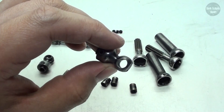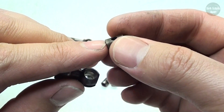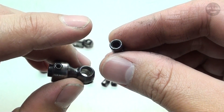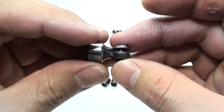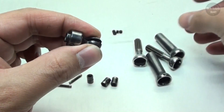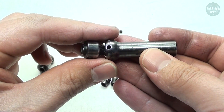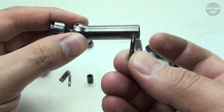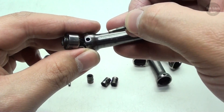I'm going to start off with the top of the drive shaft. Then I'm going to get one of these cylinders. On one of the sides, there is some threading. I had to put some thread locker in there because once I put the grub screw in, we do not want it coming back out. Now I'm just going to slide this through the center of the top, and point the hole that goes right through the middle off to the side. Now I'm going to get the top of the drive shaft and slide that in position. This long pin has a flat side to it — it's going to have to face the side of the cylinder where the grub screw is going to be screwed in.